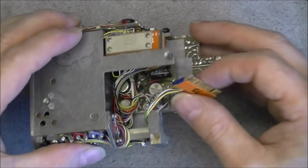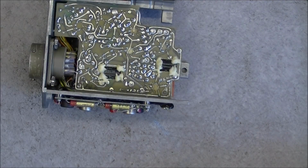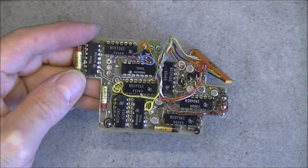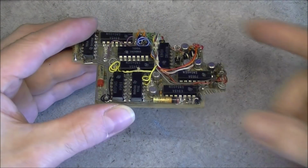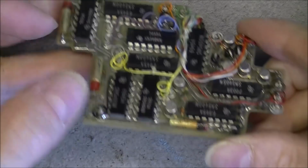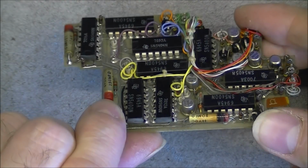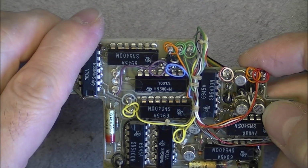Okay. So this is coming off. Some kind of insulating layer on this PCB, with just the ICs we did see previously, nothing on the other side. Nothing particular here except for this suspiciously different capacitor. Look, same model as these ones, but this one has a big black ring. This one a little bit also, but this one is okay. Interesting. Little 2N2907 transistors.